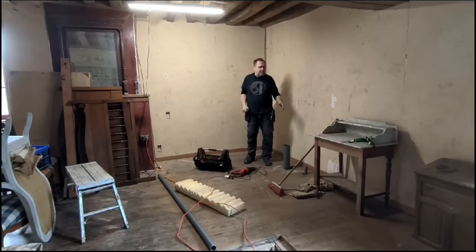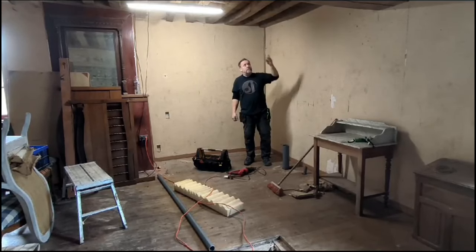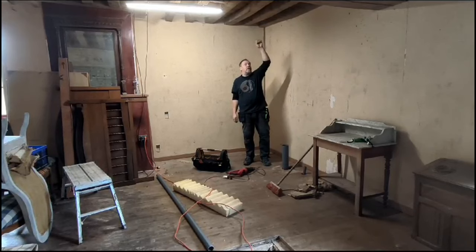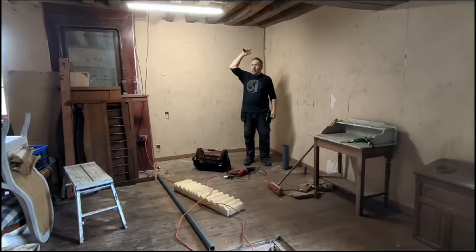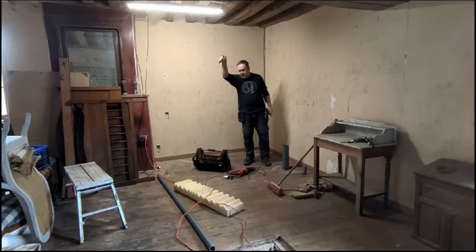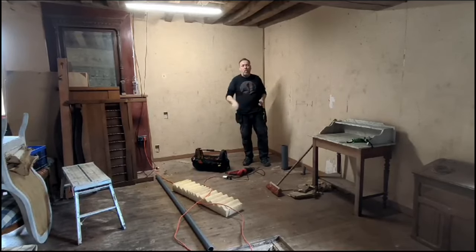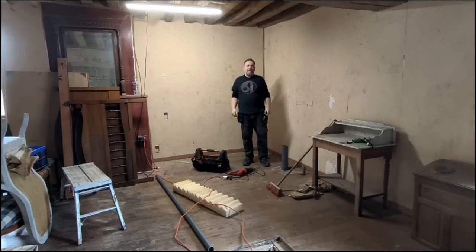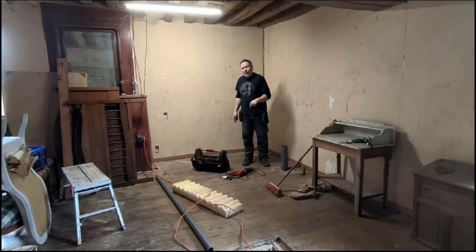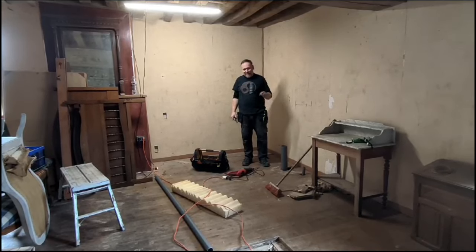It just makes a lot more sense in the fact that it's a lot easier to deal with. The pipes will come from under, over the top, down the wall in here, the bung's going in there. Then all we need to do is run one pipe down into the laundry room in that corner where there's going to be a wall. The best thing in all the world now is I'm going to go and do my plasterboarding in the laundry room.